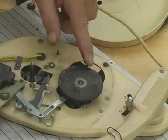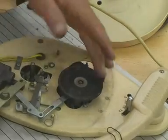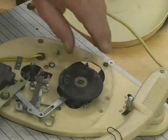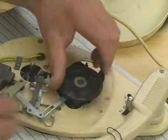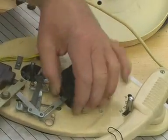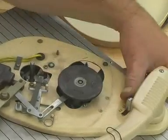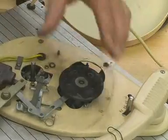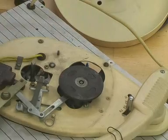So now the turntable rotates okay. What about the drive? You can just see the top of the motor pulley — the motor's free enough. And this is the idler wheel, and listen — the bearing of the idler wheel is badly worn. The actual surface of the idler is pretty crummy. But the worst of it is that the selector won't work, because this idler wheel is not free to move up and down on its spring loading. So we've got to fix that first.